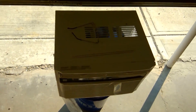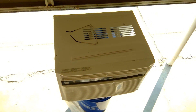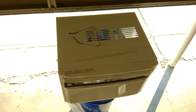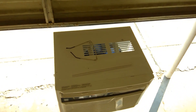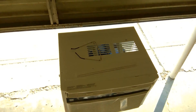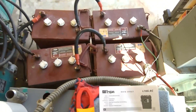That was an 8000 BTU. If I had a 5000 BTU AC it would probably have been drawing, if I had a high energy efficient one — maybe 12.2 EER on a 5000 BTU — probably somewhere in the neighborhood of 375 watts, which is a lot less than the 600 I was drawing. So you can see how just with four batteries — granted, these are very high amperage, 320 amp-hours at the five-hour mark.